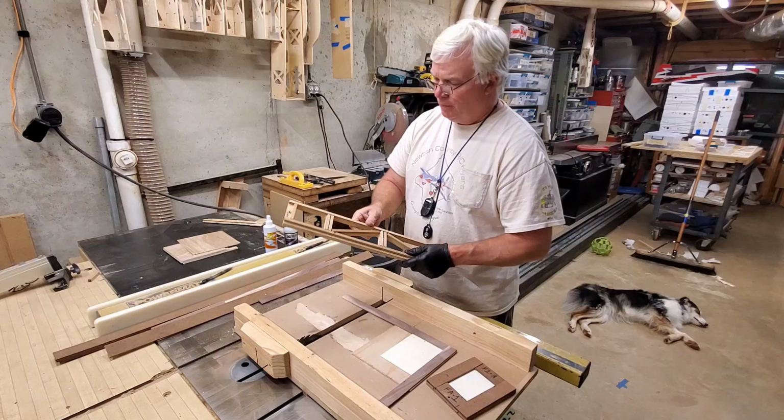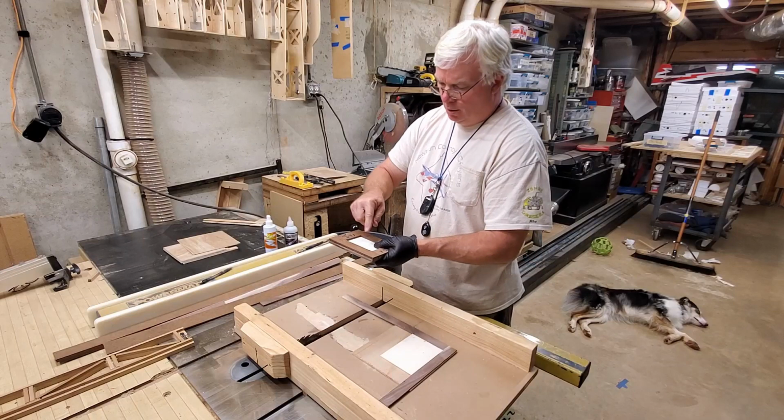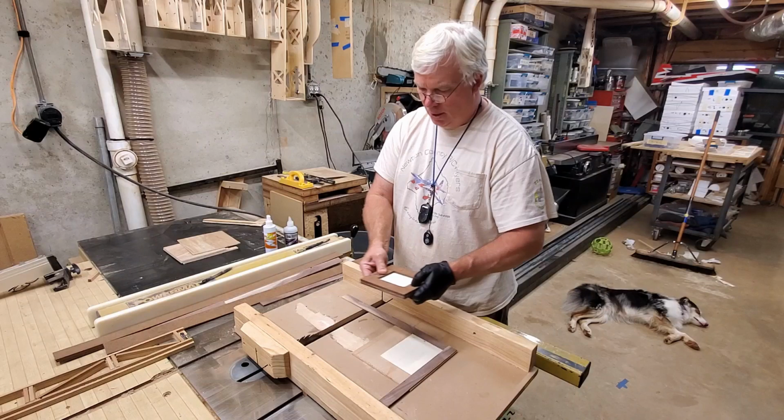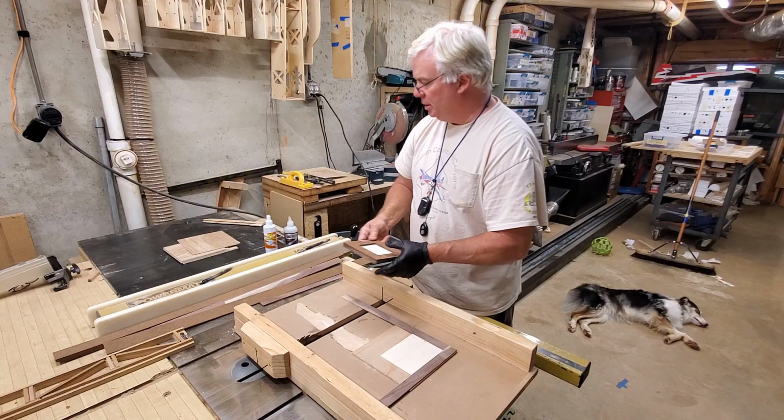And essentially these are the same two types of parts, except this one has a spacer between, so we can slide that former blank in, drill a hole in it just like we're used to seeing, and then take it over to the router table, set it down on the router, and then cut those pieces out, pull our little top keeper piece out, and then pull our finished former out. So let's get putting this thing together.